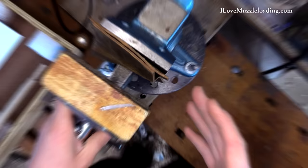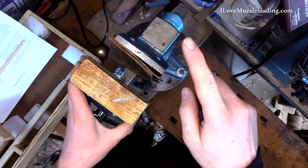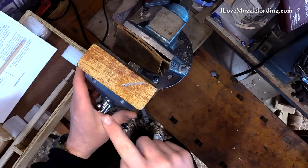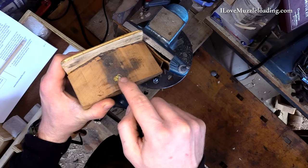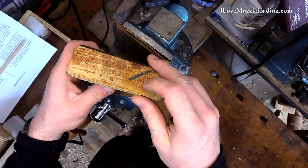As we work on this much nicer American long rifle kit, I want to make a couple of notes about things I've changed in my work setup. I'm using the same vice setup — it's a Versa Vice. I have the TSS Steelworks ball mount that it's hooked to, which allows me to pivot and rotate as I need. This Versa Vice doesn't have the tilting jaw like Kibler's does in his videos, but I mocked up a filler based on one my father had. This is just a cut piece of hardwood — I think this is cherry — with an angle cut in the back. There are two magnets on the center flat to hold it against the vice, leather on the interior side to protect the stock wood, and a sheet of plywood on top to keep it level.